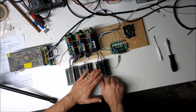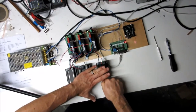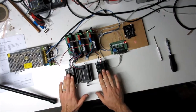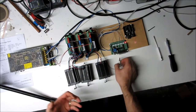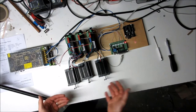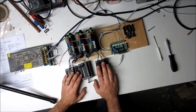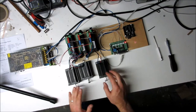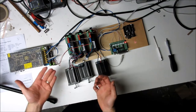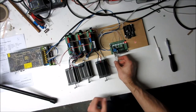If I pull the 5V off the board, the motors engage — they're enabled because they're not receiving a signal from the board. I can turn them if I really try, so they have quite a bit of holding torque even at the lower current I have set now. You'll also hear a small whine; I'll lower the current so they don't get too warm at idle, since stepper motors draw full current when stationary. When running they actually run cooler unless under heavy load.